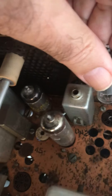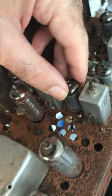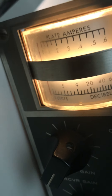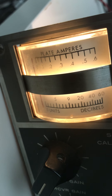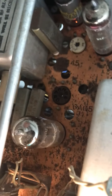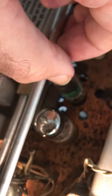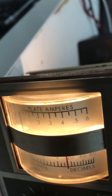Let's put this tube back in here. Okay, it's in — give it a little push. The tube is in and the meter will now go negative because that's the other side of the bridge. Yes, it's going negative because the bridge is unbalanced — the 6GQ5 current source is out. So let's put the 6GQ5 back in and then we'll have a full bridge, and the meter will discern if the IF is working or not. Okay, 6GQ5 is in — the meter should rise a little bit. There it goes — wow, it's really going up.